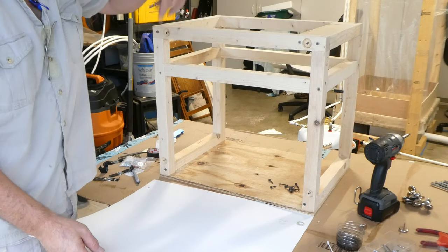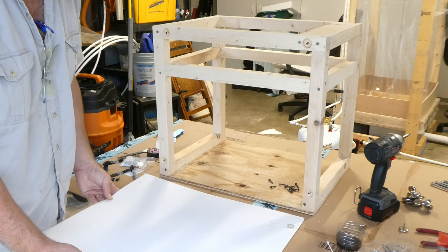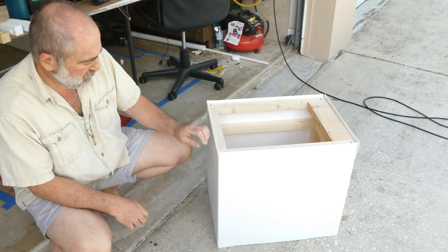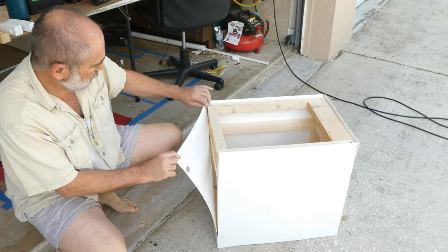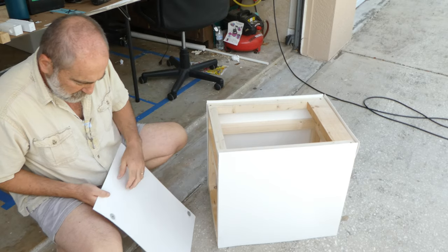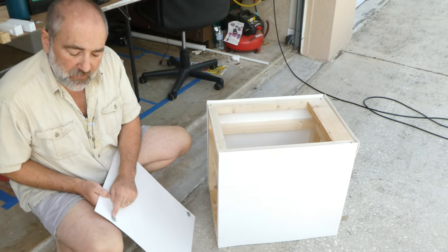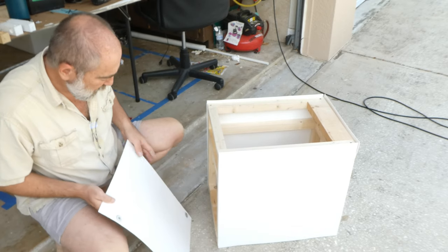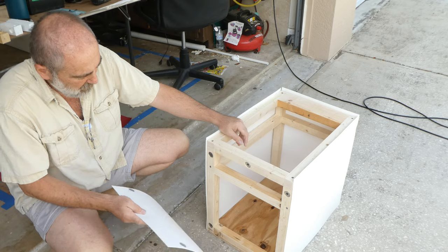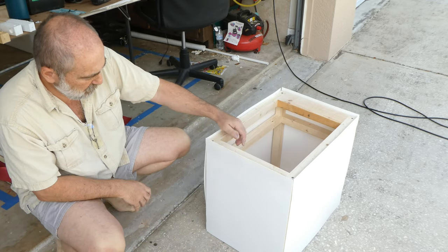Now, I have to do that for all the sides, put epoxy on them, and wait a day, make sure everything's glued up tight. I've finished the sides and placed all the magnets on the frame of the composting toilet. Each washer that's glued onto the polywall matches the frame where there's a magnet, and it just snaps on there.